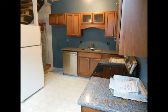So over a period of several months, I talked with architects, some engineers, and some contractors, and Kirk Ralston came up with an idea of sistering the joists that are above the post and extending them to other joists. Thus, the load would be taken away from the post. And I thought that was a good idea, so that was the plan.